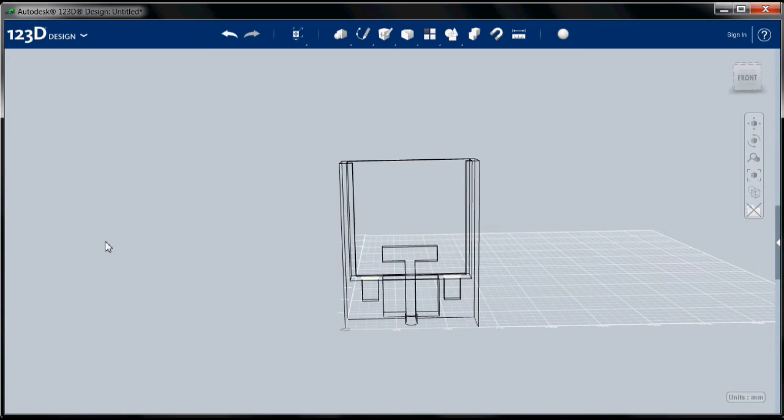All right, now, this is the tricky bit. We want to, at the bottom of those holes, this is one of the issues that I was talking about with the CAD functions in 123D Design. There's no way to extrude from the front in to meet those holes. That's sort of what you'd be thinking of if this was a machine function. So you have to do your sketch on the inside front wall of that hole and extrude it out through the face to get things to line up. That's a little tricky. Watch this.